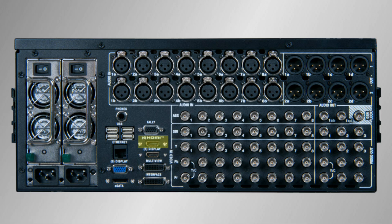Output number four is an HDMI connector allowing you to output audio and video across a single cable. This output is also configurable to follow the setup for output rows one or two, duplicating them in HDMI format. Output number five is an HDMI display-only output designed to drive a projector or an external display. This output can only send video and can be configured to follow outputs one or two, or set up to display network inputs, media players, or frame buffers — making it perfect for second screen content like computer presentations or support videos.